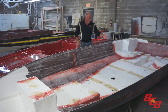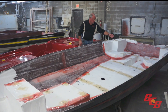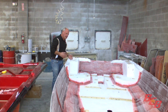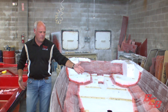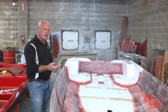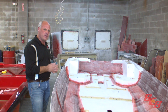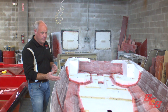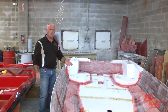This one's got the front foam chamber. All the rear foam chambers are in place, and then the floor is foamed. You can see there are eight separate areas that we integrate foam into. That encapsulates all the foam, so all the foam is contained inside of these foam chambers. Down the road ten years from now, none of that's going to be in the gunnels of your hull absorbing water — it's all going to be contained. As long as you keep the integrity of these boxes in place, don't drill them, don't leave something unsealed, they'll be dry, and that foam will maintain throughout the whole life of this boat.